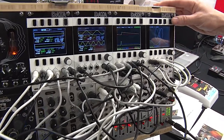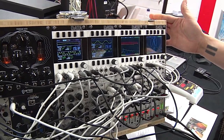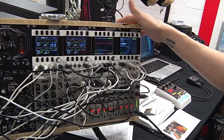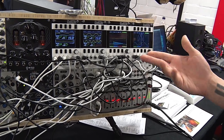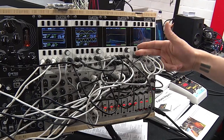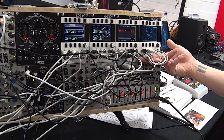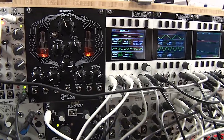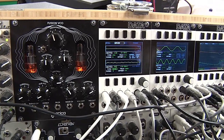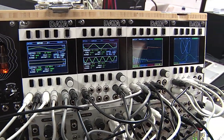Switching there, I'm gonna trigger off of any of the four channels. You have a cursor so you can actually do measurements, time scale obviously, you can stop and start the display. You have the four inputs here, and right below it you have four buffered outputs so you're not getting any voltage drops, so you could be running an oscillator and not have to worry about any of that. So this alone would make it a great module.